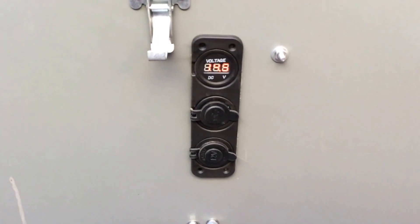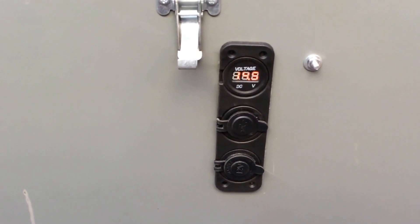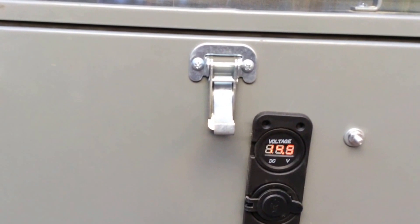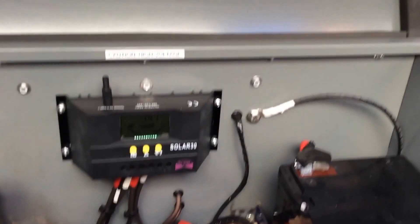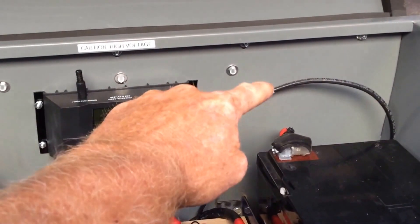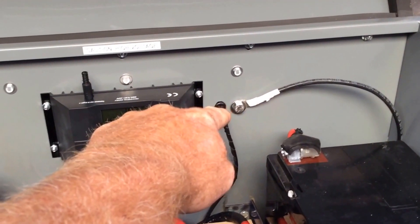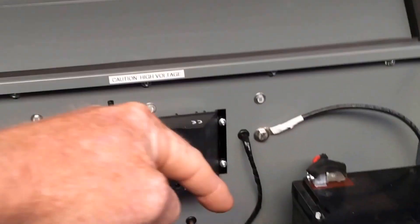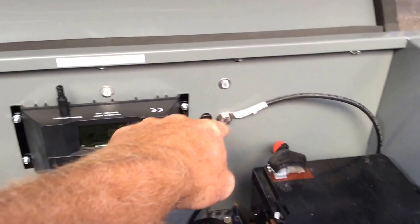Now take a look at the box. It's early morning, so right now it's at 14.5 volts — it's early, charging up. Go ahead and open the box to see some changes going in here. What you see here is my grounding lug; this goes to the outside of the box where the other black cable connects. I have a wing nut so I can ground it quickly. This goes over into my inverter and it grounds the whole box, so the whole case is grounded.